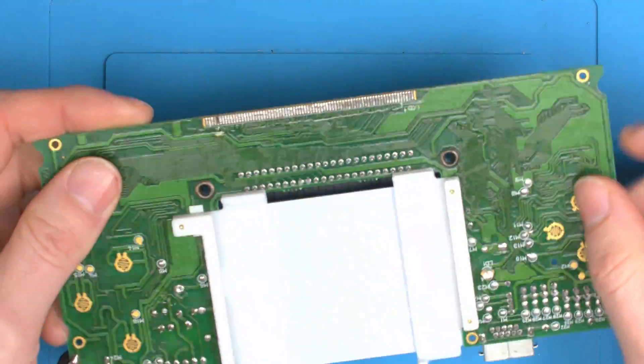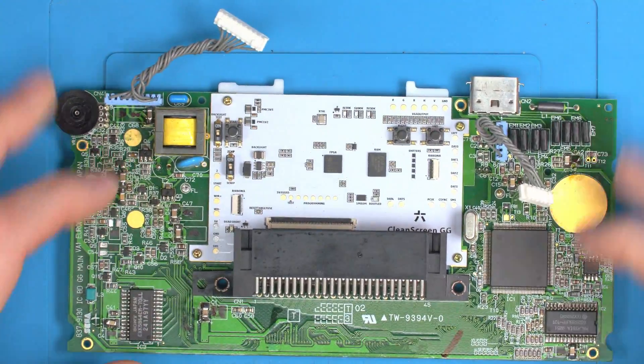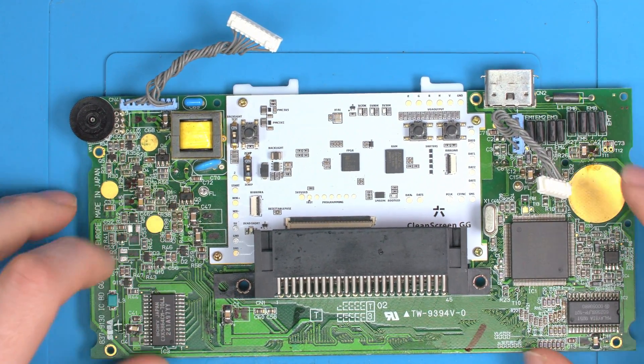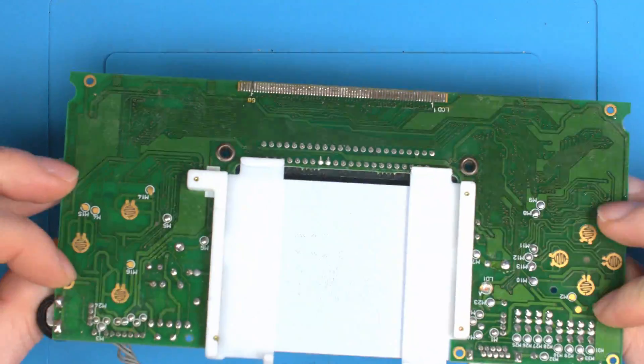The install is quite a bit simpler. There's no need to have any functional pins over here, which is what most people struggle with. The ribbons are more accurate. All I've gone ahead and done so far is removed L2, which is the only thing you need to remove, and removed the old backlight and fuses.